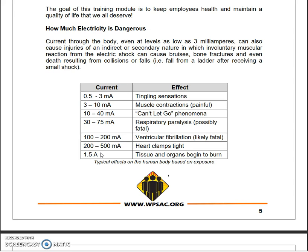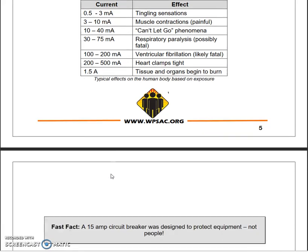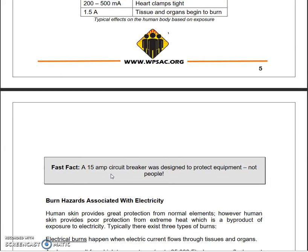So it's not a lot of energy, not a lot of charge has to flow through a human in order to cause us damage. Think about the size of a typical lighting circuit, about 15 amps. There's not really much going on there in terms of what a circuit breaker sees. So this is why we have things like ground fault circuit interrupting devices, GFCIs, or sometimes called GFIs, and they're built in line because they see a difference between the loads and the lines.